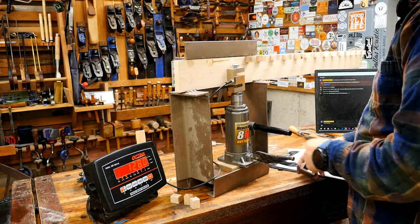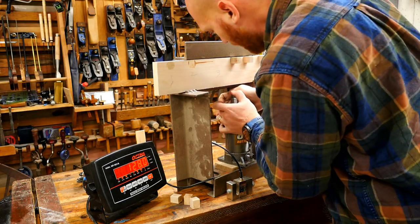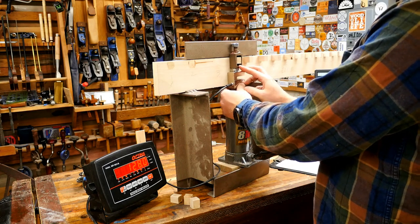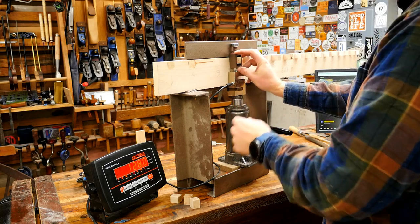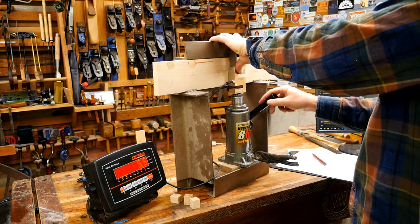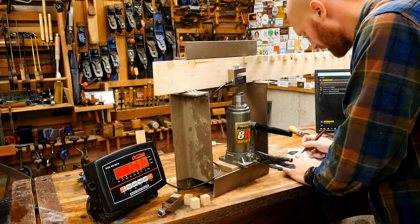128 — that's actually rather consistent, last one was 112 pounds. Someone asks about gorilla glue — I tested it in the last series and it was okay but not a great wood glue, and absolutely horrible at gap filling. Do not use gorilla glue for gap filling purposes. I do have gorilla wood glue in this set, plus a few European and German glues. This one came out at 109 pounds.